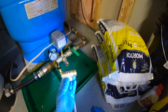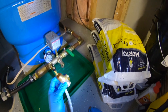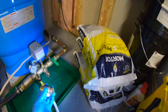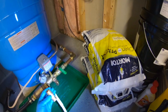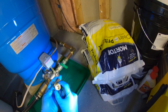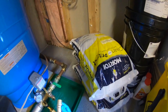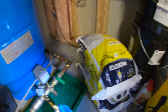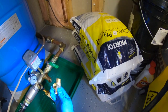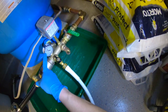While we're waiting for the pressure to come out, I've got a replacement valve. The thing you've got to watch out for is that these valves come in different sizes — you can get them at Lowe's for about 15 bucks. This is a three-quarter inch valve; three-quarters is the dimension from here to here. There are basically two sizes: half inch and three-quarter. The biggest thing is to get the right size. Generally you'll find three-quarter inch, but some wells do have half inch.